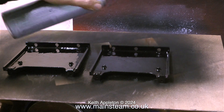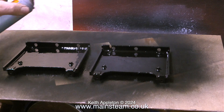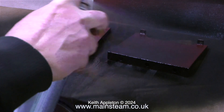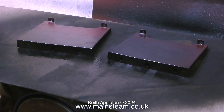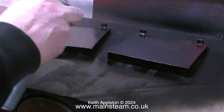I start with one thin coat, then go over with another coat, and eventually apply quite a thick coat for the final one. In this clip I'm painting the inner surface of the two side plate castings — this isn't very important because the inside is going to be covered in heat insulation material. These castings are not very smooth and I did think about using the linisher to flatten them off, but I decided to just keep this period look as it was built.